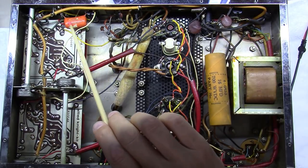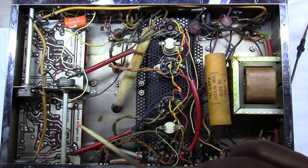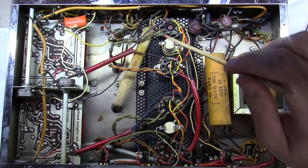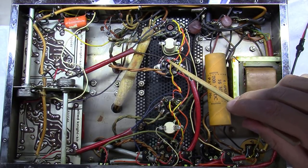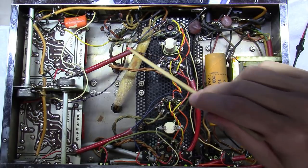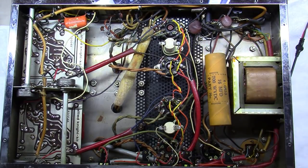There's a capacitor on the front end that's a noise capacitor on the switch - we'll replace that with an X-Y safety cap. We've got the fuse holder, a test switch I'll need the schematic for, the input jack, a mono/stereo switch, and a coupling cap on the front end. These are the driver boards. These are the five grid resistors feeding into the tubes - on a 6L6, pin 5 is the grid and pin 6 is unused, so they're using that empty socket pin as a jumper point through a 1K ohm resistor into the grid.